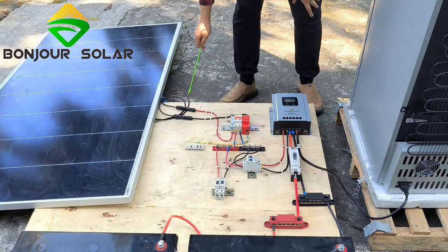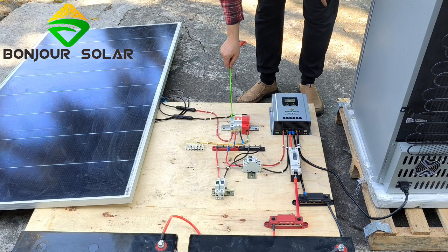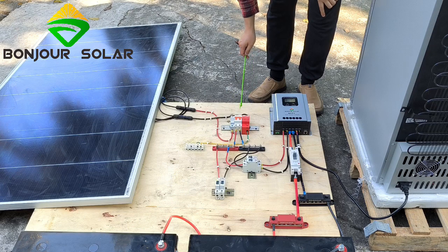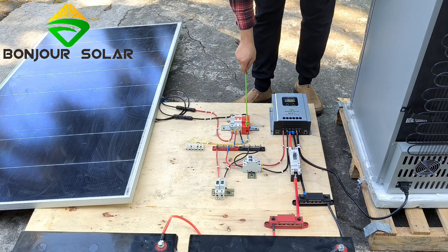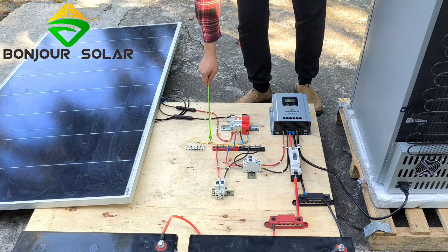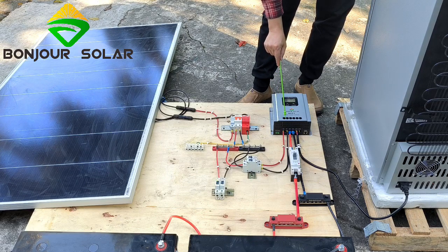The same applies to the negative side. There is a breaker for the negative — we do not need a fuse on the negative because if the positive fuse blows, there is no current from the panel, so one fuse is sufficient. The negative runs in parallel with the surge arrestor as well. You must pay attention to the ground connection — the earth cable. You must connect the earth cable when installing the solar panel system. This is very important when making the surge arrestor connection. The bus bar then connects to the MPPT.